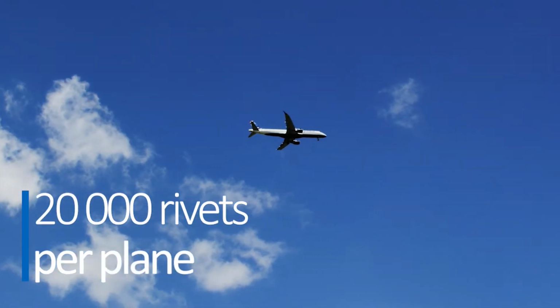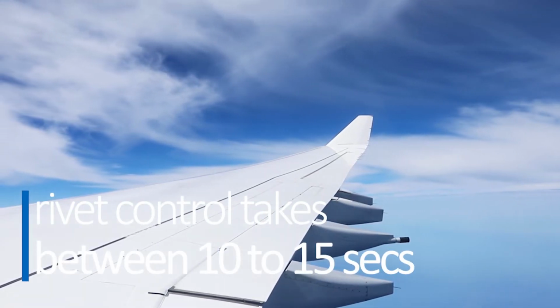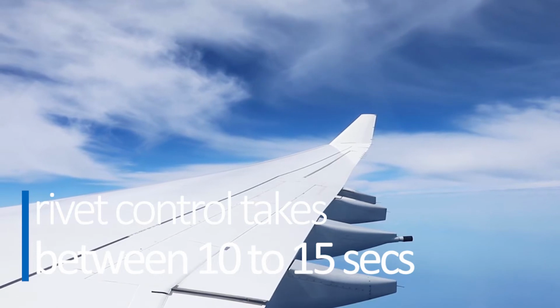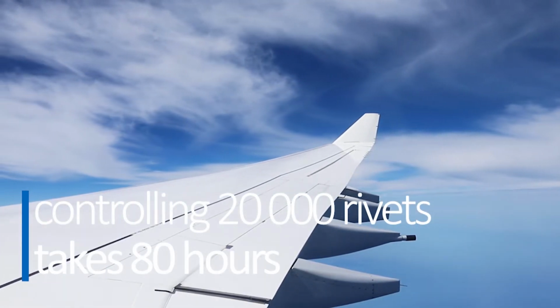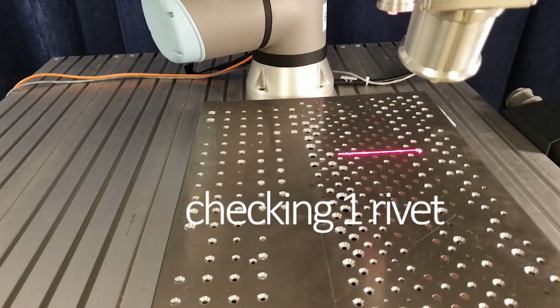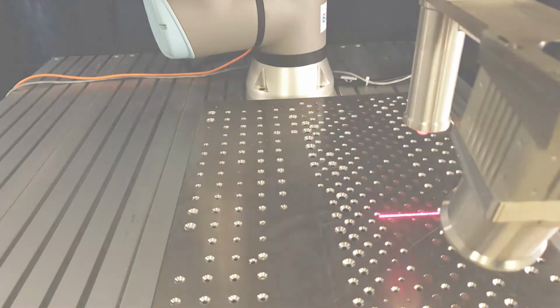The assembly of an airplane consists of about 20,000 rivets. A qualified operator takes between 10 and 15 seconds to check the quality of a single rivet. About 80 hours of work by an operator is required to check 20,000 rivets. With the Rivet Inspect solution, inspection is done in less than a second and traceability is immediately accessible.